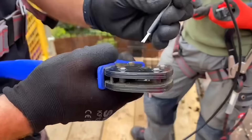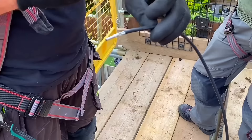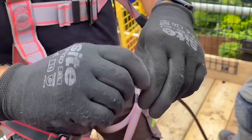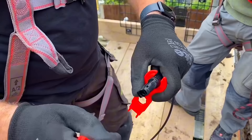You lost one? Not like a coax where you're going to have a poor TV signal. There we go, so we're in. It's a significant crimp. And again, what I said before — if you had to put the housing on first, you'd have been in a struggle. See if we can hear this click this time. I heard it that time. Hand tight again, and we just hear that clicking sound once again to know we're properly tight. That was easy.